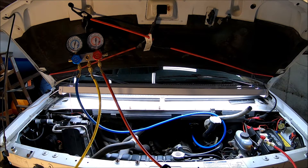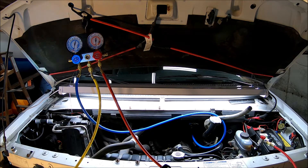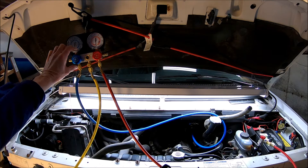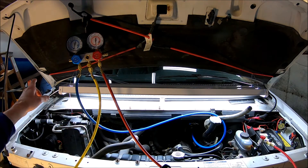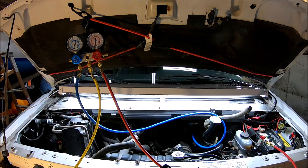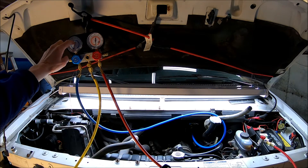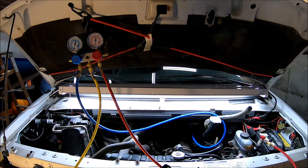I've already pulled a vacuum on it — it's down as low as it'll go, pulled down to 29 inches, and it's been sitting for about an hour now with these gauges closed, so the pump is isolated from the van. These hoses still read pressure up to here, they just aren't connected anymore. That's what these valves do. And it's been sitting here holding just fine, hasn't moved a bit. So as far as I can tell, everything is nice and tight. So what I'm going to do now is put eight ounces of ester oil in there.